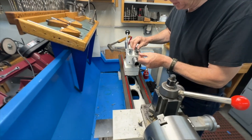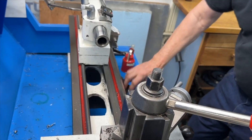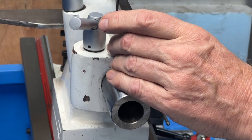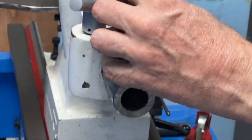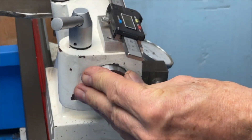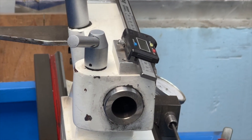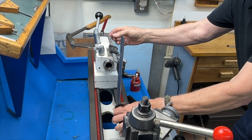I first mounted this. The top of this tailstock is almost dead flat so I didn't have to do any shimming there. What I did was pull this in, took a square, set this on my bed, read where the end of it was, and then extended it out.